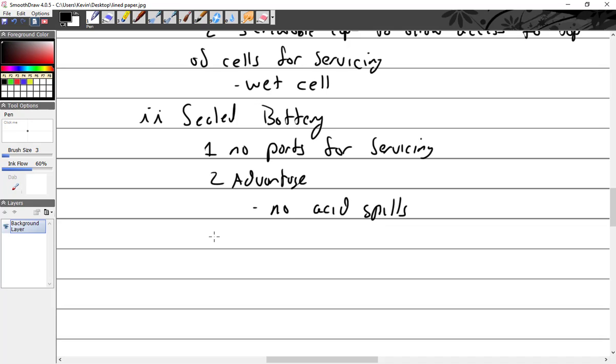The reason the battery out of my airplane is here is because somebody who will remain nameless, it wasn't me, but his initials were Joe, serviced the battery and noticed it was low. What should you add? Distilled water. Instead he said we should add electrolyte because that's what's in it. So he poured straight battery acid into it and then overfilled it, and under a charge it spewed this stuff out because it'll find a way out, all over the side of the airplane. When I bought the airplane, I had to fix that. But again, I'm not pointing fingers at anybody. That was really hard on the battery and the airplane. So those are the types.